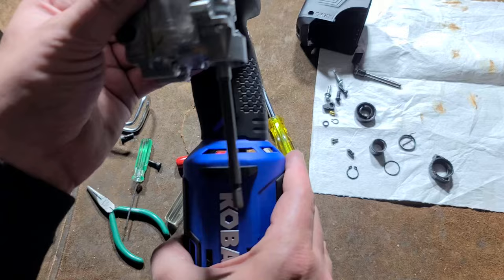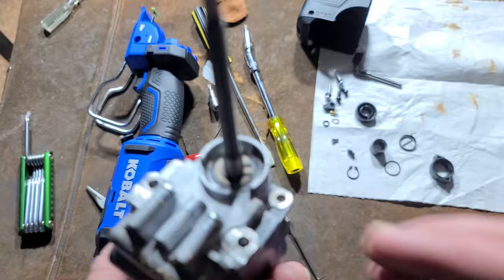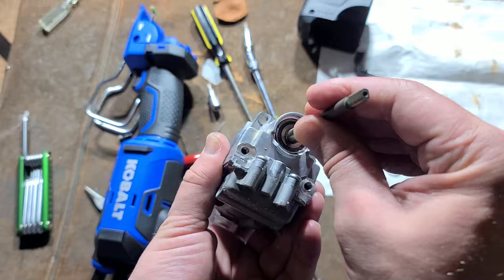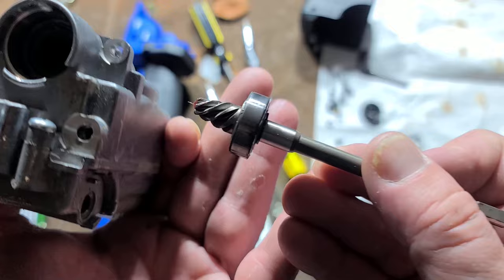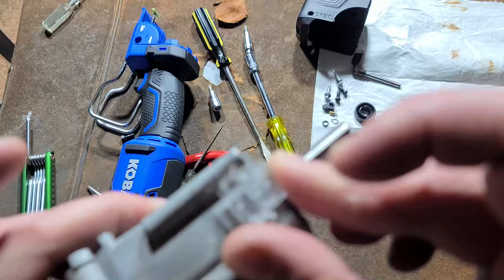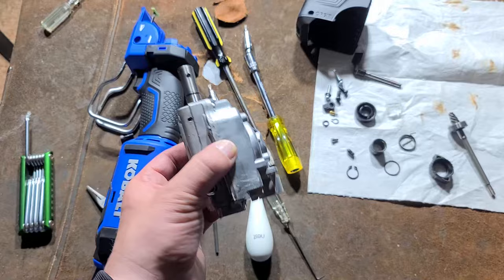Once you remove that you can see how the lever pushes out, and you can walk the gearbox out. You can see the drive shaft going right through the handle. There are rubber sealed ball bearings and ball support bearings, so the build quality is actually decent. There's a snap ring keeping the bearing in one spot, and it pops right out to reveal a tapered spiral — a spiral bevel gear, a nice helical cut gear. Normal Phillips head screws on the gearbox once you're inside, but security screws to get there.